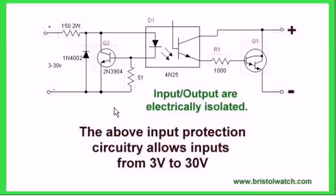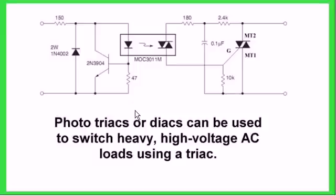Here is a fairly complete solid-state DC relay — the protection circuit we talked about earlier, the optocoupler, and the transistor switch all together. I've built this and it works just fine. There is also another variation using phototriacs or photodiacs, used with triacs and SCRs to create solid-state AC relays — that will be a different video. We'll go over how triacs and SCRs work in separate videos as well.